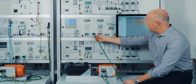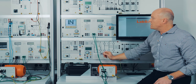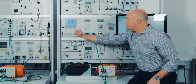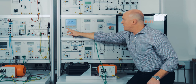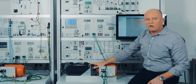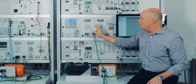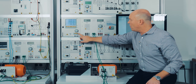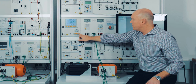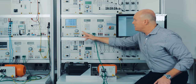The multifunctional analog-digital multimeter is used to display different voltages, currents, and powers. By pressing this button I can show the voltage, the current, the active power, the apparent power, the reactive power, and the cosine phi. Simultaneously I can display four values and switch between digital and analog display. In this case I'm going to display the voltage, current, active power, and cosine phi.